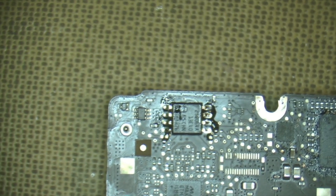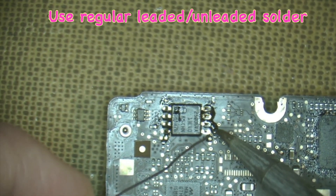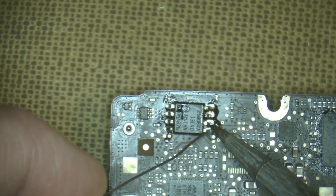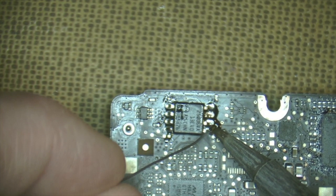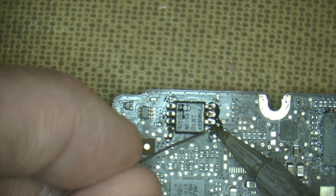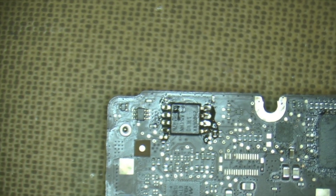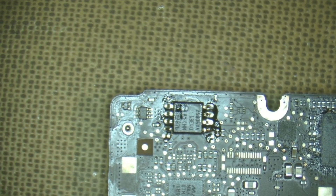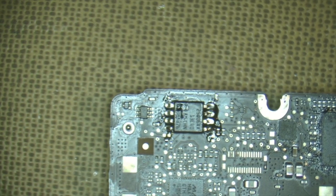You're probably asking what does an EEPROM do in the first place. An EEPROM is a small basic memory chip that all devices have - TVs, computers, car dashboards. It carries a tiny amount of information to basically tell the device basic things such as language to operate in, the serial number of the device. If you're looking at a speedo or instrument cluster, it holds the odometer settings and readings - just a small repository for information.